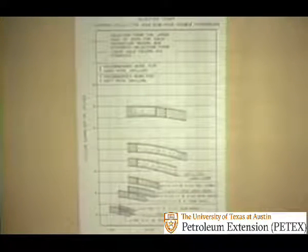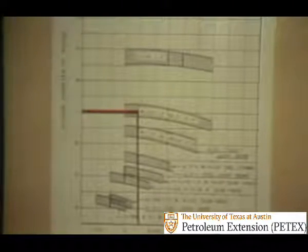When the bending strength ratio is two and a half to one, this is known as a balanced connection. Engineers have developed charts that help pick the best combinations of connection size and types, outside diameter and inside diameter. The shaded areas on the charts show the range of outside diameter and inside diameter to maintain a balanced connection of a certain size. For example, a seven inch outside diameter collar with a two and a quarter inch bore falls in the shaded area shown for a four and a half internal flush connection. This connection would be balanced for this outside diameter and inside diameter.